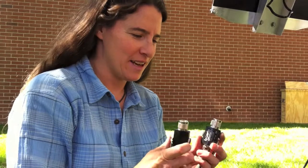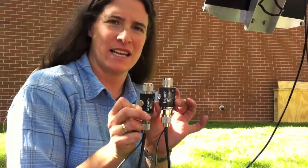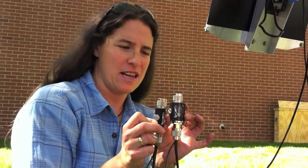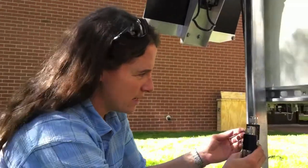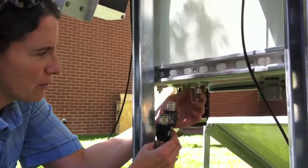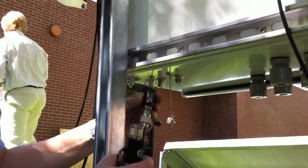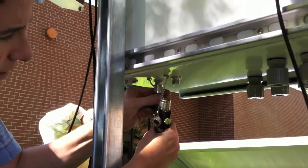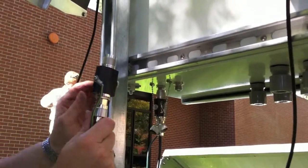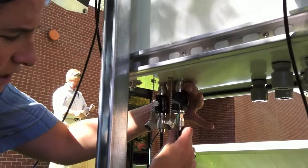Now that you've attached your antennas up on the top of the box, we need to attach them to the bottom. Each antenna has a small lightning arrester attached to it. The lightning arrester goes in between the cable and the box. We'll open up the ports on the bottom of the box and attach the echo antenna to the echo antenna port and the 3G modem to its port, tightening those on.